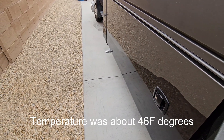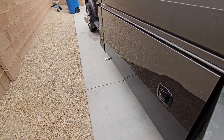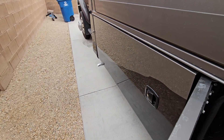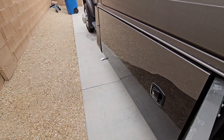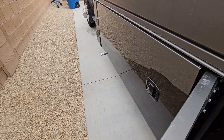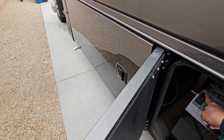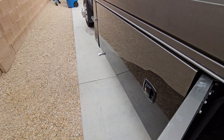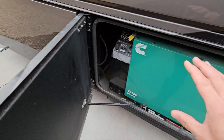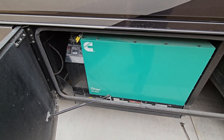You can see how hard it is to start — and this is only mid-40 degree weather, so it's not really cold. When that generator kicks over like that, it should actually start immediately. You can see all that white smoke, and that white smoke is basically unburnt fuel. That tells me right away that something with the glow plugs is not working. So let's deep dive into this generator and see what it is.